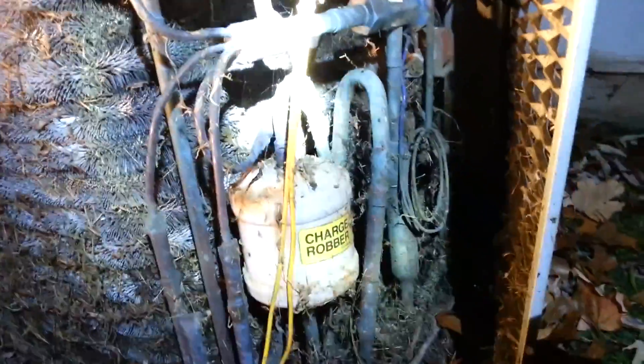Something I wanted to point out: on these older units, or any unit for that matter, the reason why you want to be careful about having your air conditioner on while the grass is being cut is because it is just packed solid with grass and it kills the efficiency. With these louvers on there you can't really see it — it looks fine from the outside — but you take the louvers off and see how all that grass is packed in on all these coils. I'm going to clean all that off while I've got it apart.